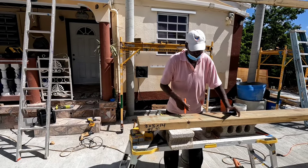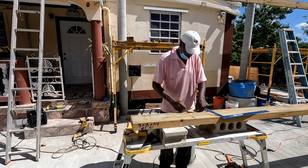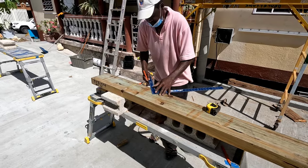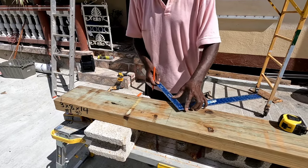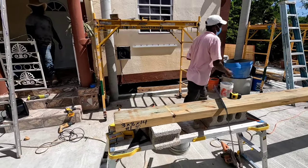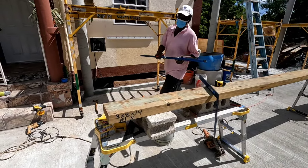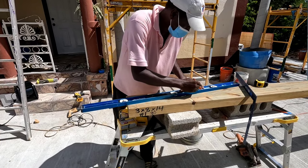Then I cut — I have to cut this way, so I take two inches on this side, two this way. Then I take my square and go this way, so this angle and that angle are very much the same. Now I take my long level and go this way, and then I mark straight across.